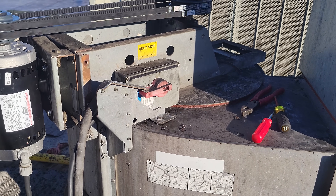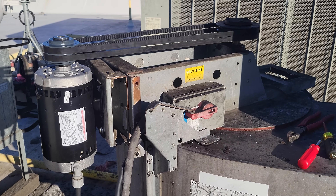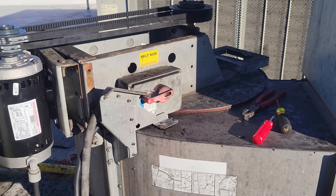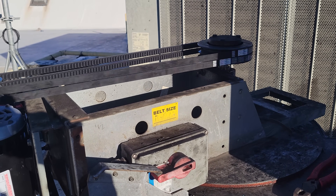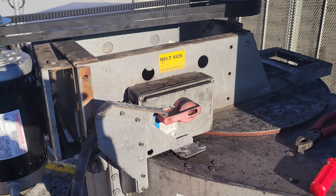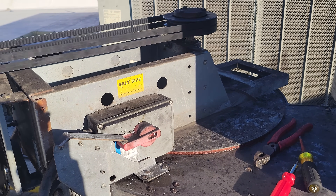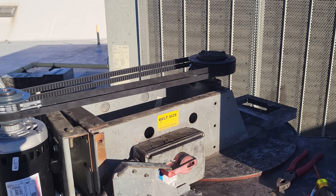We are running and the fan does have a vibration to it. That vibration could be part of the reason why the bearings had failed on the previous motor. They need to clean this fan — all that grease buildup inside is what's causing the vibration because they're probably not doing regular PM on the cleaning service. It's very important they have a service company like us service the fan, but also professional grease cleaning companies need to clean these things on a regular basis, especially with a charbroiler below here. We're letting it run — it's corrected, running in the right direction — but you want to let it run for about 10 minutes and then turn it off to double-check the tightness and alignment on that pulley.